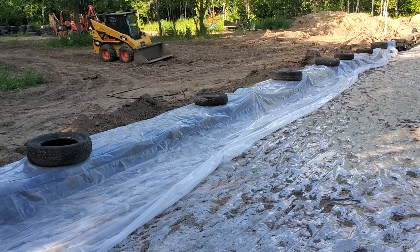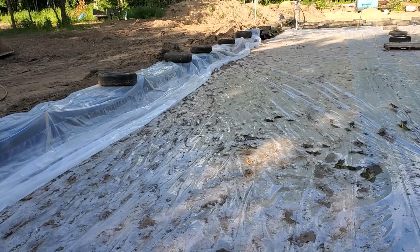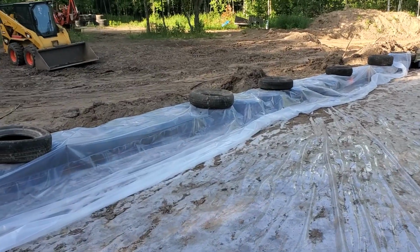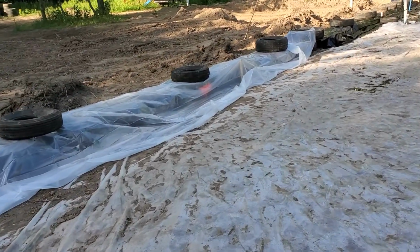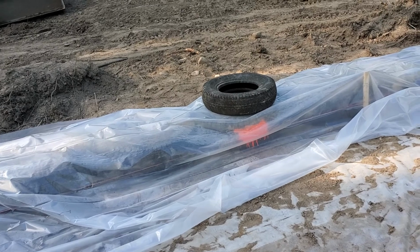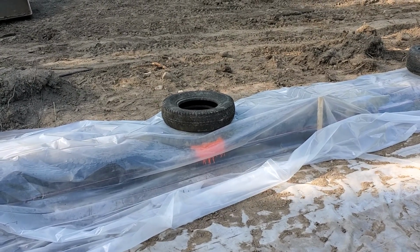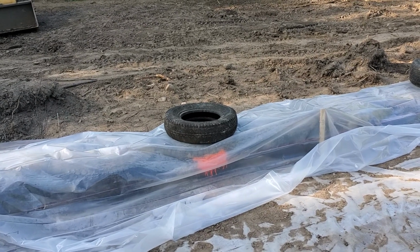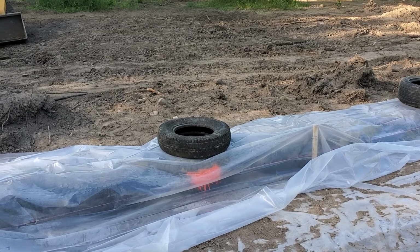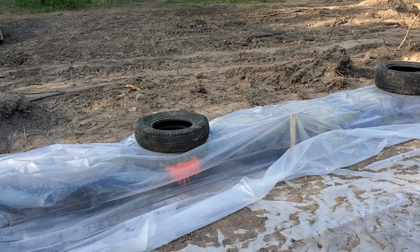So what I ended up doing was I stopped and regrouped, and stopped in the middle here and created a master tire to go off of. So we tamped it down as we're going here, and then leveled it off, and there's orange paint, as you can see on this one tire here. I'm gonna walk over here, there's orange paint. So what I'm going to try to do is about every 4 tires or so I'm gonna shoot. I don't honestly know if this is gonna matter, because it seems that these tires just kind of absorb the level on the next row. You can kind of just level it off, but I want to make sure that the first row is flush, and we'll see how that plays out, because I just want to make sure that the front, the lowest row is pretty dang close to level. And then after that, I hope it's going to be a breeze.